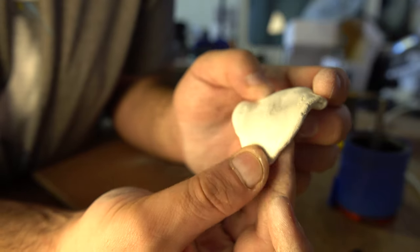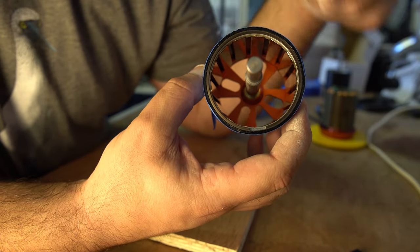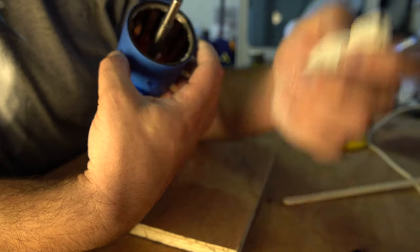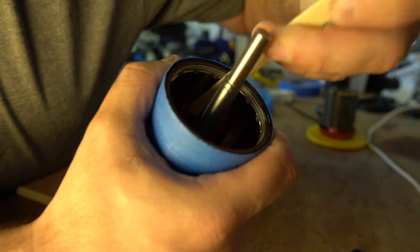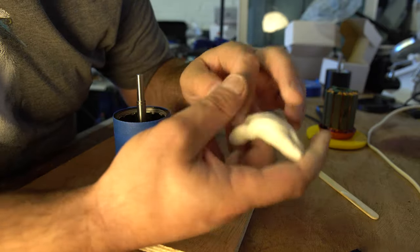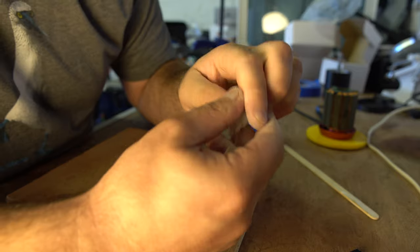After about 10 minutes the streaks are gone, it's all one even color and it's quite soft and pliable. We need to get it between those magnets in those gaps using a spatula. We're going to create a sausage out of this, lay it in the gap where it needs to go, then use the spatula to smooth it all the way down. You've got three hours with this before it sets, so you don't have to rush. This amount should probably do all of it.